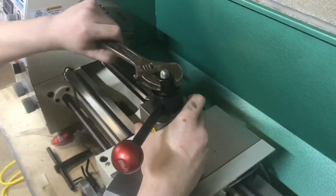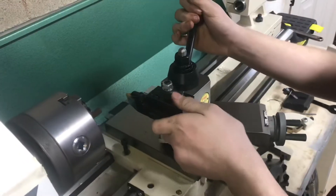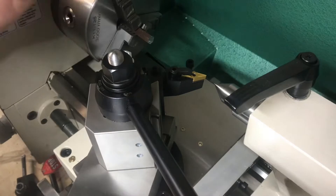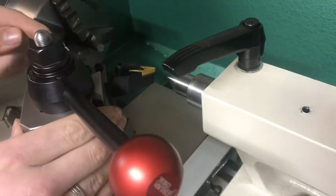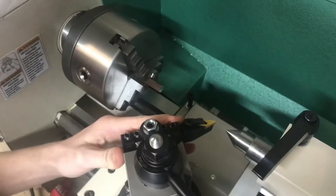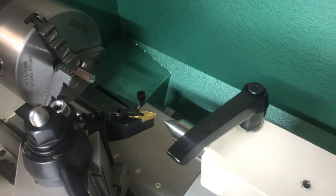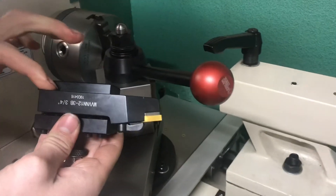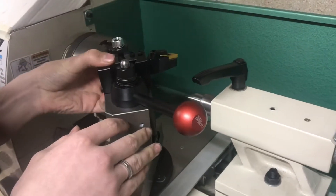We'll put this in place and drop a tool in. All the tools work great except for this turning and facing tool — the problem is it's too high. Typically you'd just adjust the nut on the tool holder to adjust height, but even maxed out it doesn't go low enough to center it, because it starts to hit the compound slide. In order to fix that, I'll probably need to grind a little off the bottom of the tool, which will sacrifice a little rigidity, but then I'll actually be able to use it to cut.